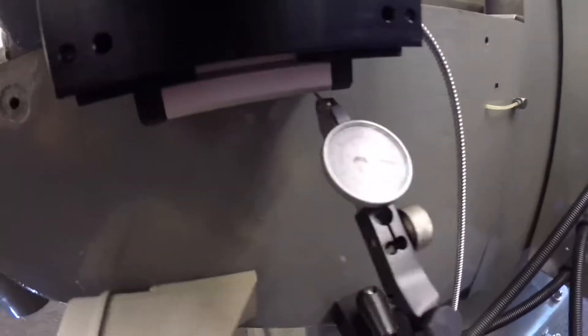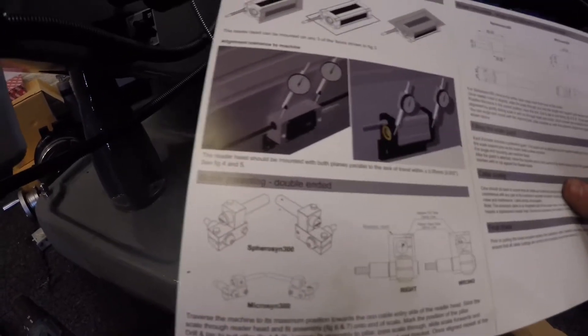Sorry for the shaky camera. As we come up back onto the bottom surface - that's half a thou. It says these are machine surfaces; they're not really, but that's what the guide tells you to go off. The guide tells you to go off the bottom pieces - on these ones it says to go off the black part. We can test off those faces and the tolerance was two thou - and that's within half a thou.